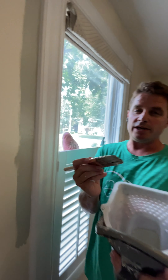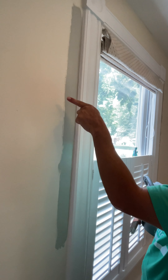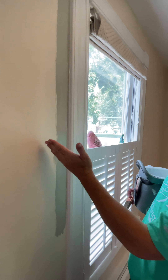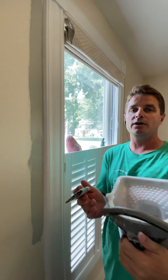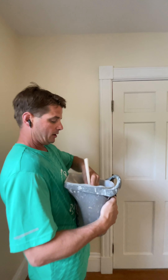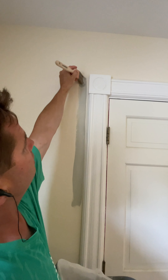Now for the camera's sake you can see how wide the cut-in is. The reason I used a two-inch brush instead of my usual inch-and-a-half is so it shows up better on film. When I'm actually cutting in, my cut-ins don't get that wide — probably about half that — because when I roll I'm going to roll as close to the wall as possible. If you were to just roll right on top of this with one coat, this whole area would end up with two coats, the sheen would be higher, and the color wouldn't match the quarter-inch where the roller couldn't reach.